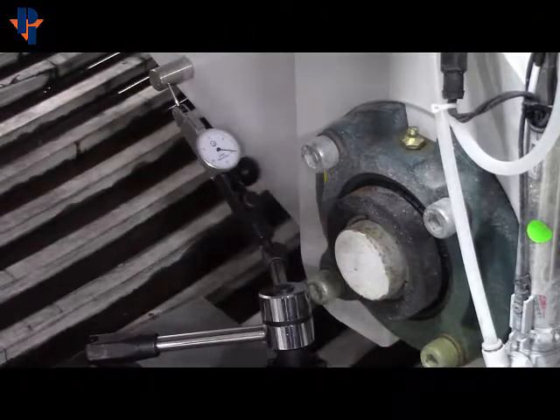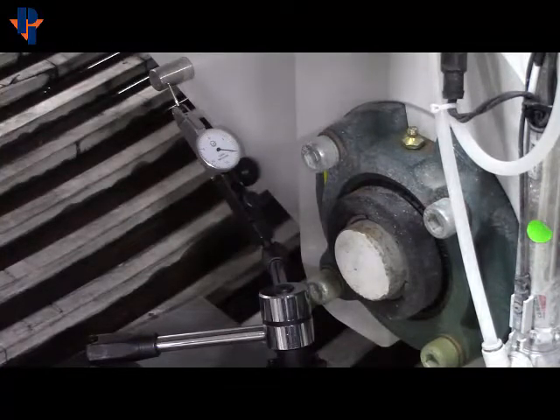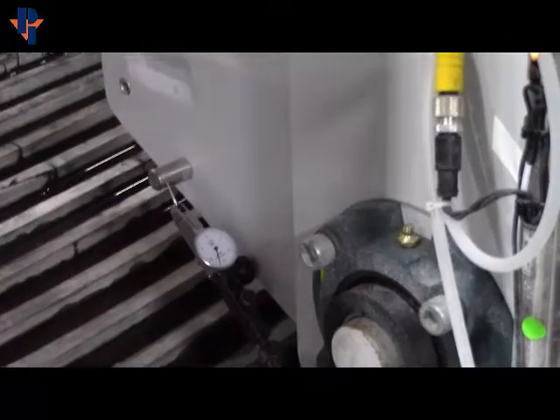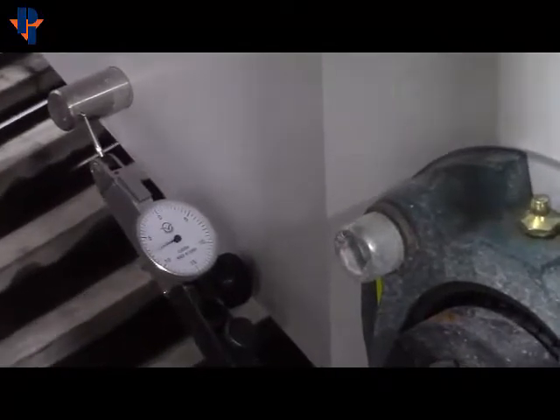When starting the Nozzle to A, you're in a very tight area — watch the bolt and make sure you don't hit the miter box in any direction. If you do bump it, don't get frustrated, just restart and try it in a different position. In this position, drive your Y negative until you hit, then run your Z up and down to find the high spot. Use the one thou and Y negative to get to zero.